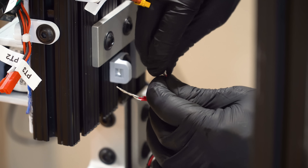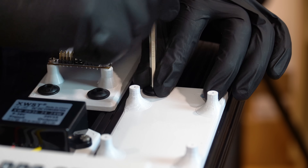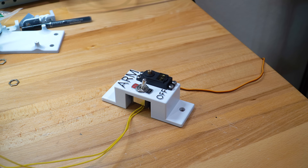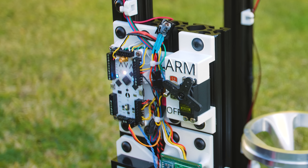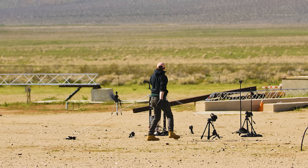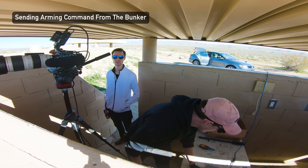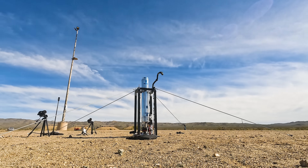While I start wiring everything up on the test stand, let me tell you about safety and arming. When you've got an igniter inside a rocket motor, you want to be unbelievably conscious of where those ignition leads are and what the current path could be to fire that igniter. For a home-built experimental motor like Simplex, we want to make sure that Ava can't go rogue and fire the motor while I'm right next to it. That's why I came up with this little doodad that lets us do remote arming. This toggle switch physically bridges the gap between all of Ava's pyro channels and the igniter inside the motor — so when I connect the leads and walk around the test stand, so long as that switch isn't flipped, I'm totally safe. The stand only becomes electrically armed once I send the command to rotate that servo, which flips the switch, bridges the continuity gap, sends a few microamps through the igniter to confirm connection, and finally lets us fire the motor.